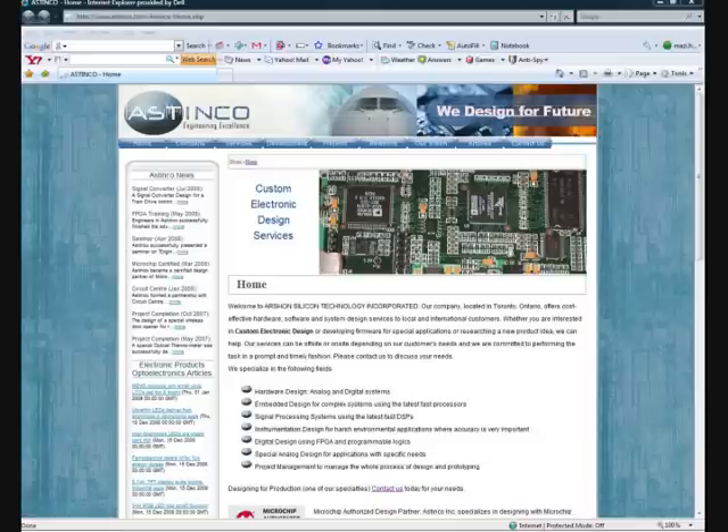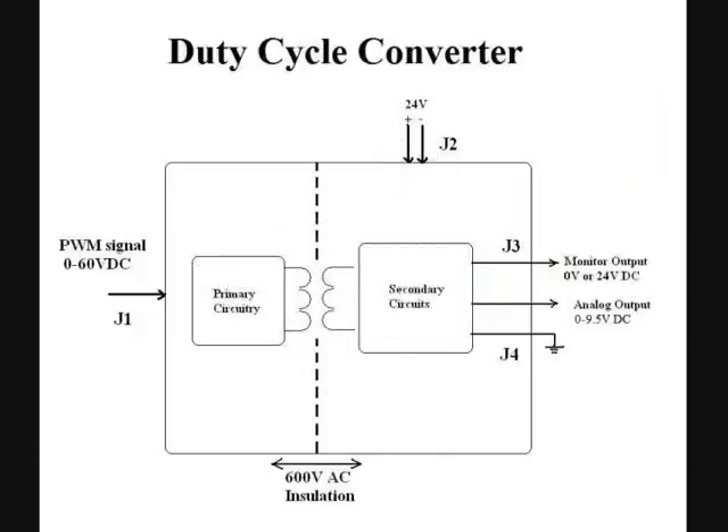This project is one of those very complex projects in terms of requirements. Here is the block diagram of the design. As you see, we have two sections: primary and secondary circuit. In the primary, we have a 400Hz pulse signal with 60V peak voltage. In normal operation, this voltage is 60V and should not drop under 30V. The duty cycle can vary between 7.5% to 45%, and this variation of duty cycle is the information that comes with the pulse. The train is designed that way because of immunity to noise or disturbances — they use duty cycle and a very high voltage pulse of around 60V.